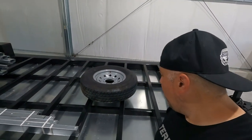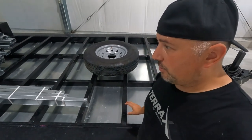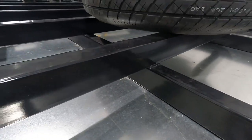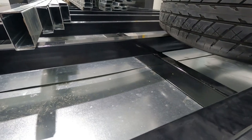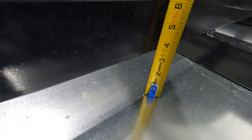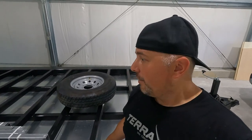You can see that even the framing structure of the tiny house is crazy deep — we're talking six or seven inches. The reason for that is cold air goes underneath and you want to stop that cold air coming up into the house, so they make enough room to insulate the heck out of this thing. We're going to talk about what insulation I'll use when I get there, but we are many videos away from that.